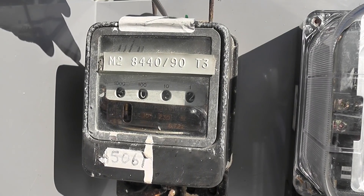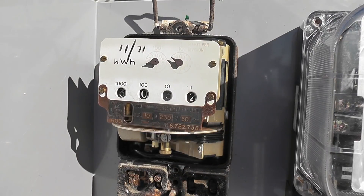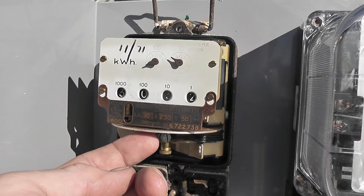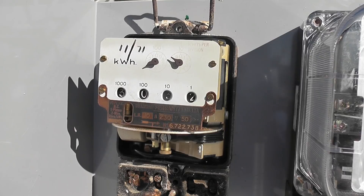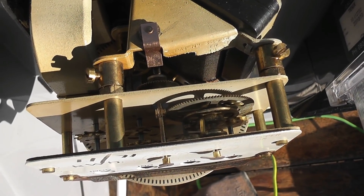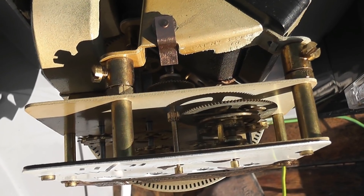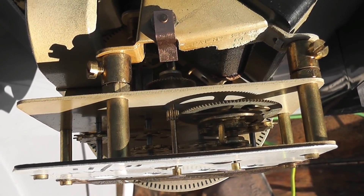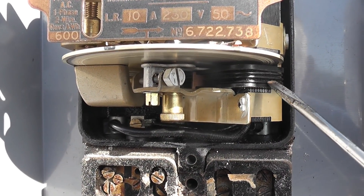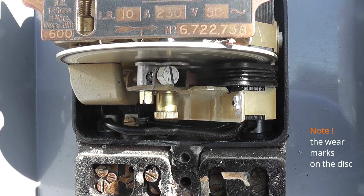I'm going to have a quick look inside this old time capsule. I've taken the seal off already and loosened the screws, so I'll take this lid off. Actually, it doesn't look too bad at all - still in pretty good condition. It is worn out, but it still runs. It's six percent slow and it may sometimes stop for some reason. I think it's a dry gear train on the register, so let's have a look on the other side. Here we have a classic Geneva movement, which is probably dating from the 1940s. Although the older FDBs used to have these gears as well. You can see the meter is now going slow, so it did have its issues.